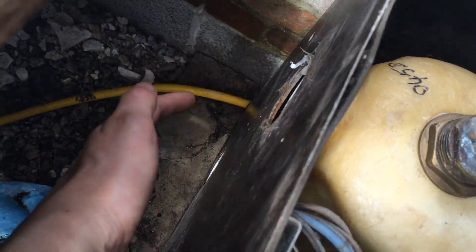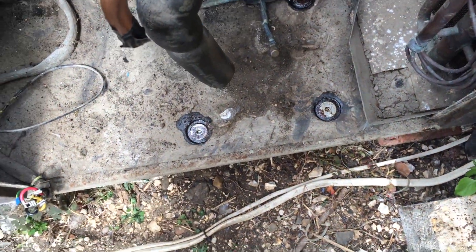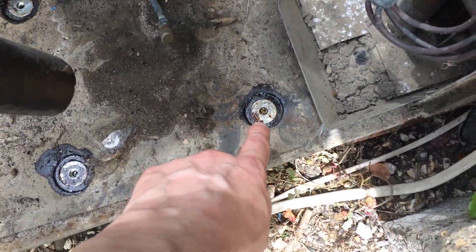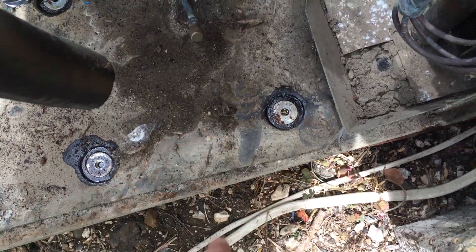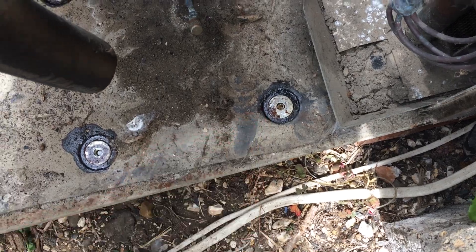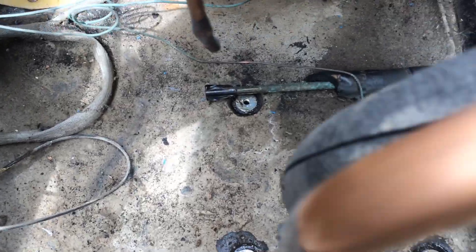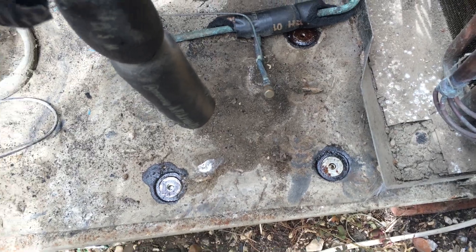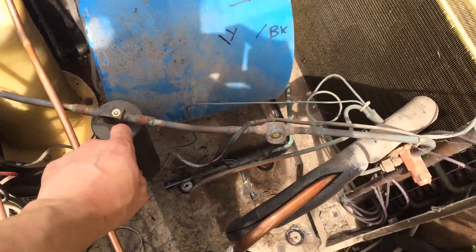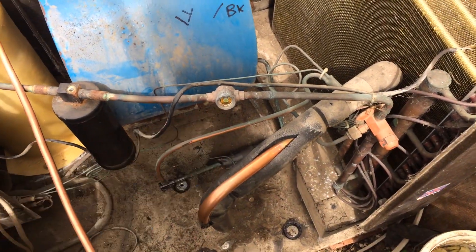We've got water connections to put in here and down the bottom. Got to put the compressor back in. I've put some grease on here — some spray grease in the holes. If I ever take a compressor off I just put some in the holes; chances are you never need to undo them again but if you do, you'll be glad they're not rusted in. We need to get the compressor back in, then pipe it up and put oil in it. We've got to change the dryer — luckily there's a sight glass here so we don't need to add another one.